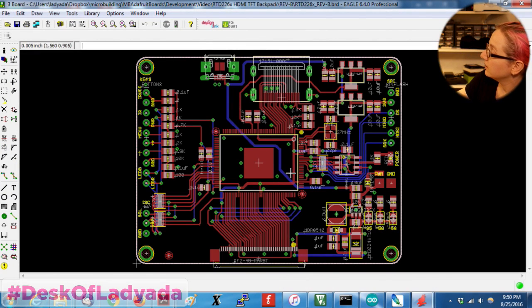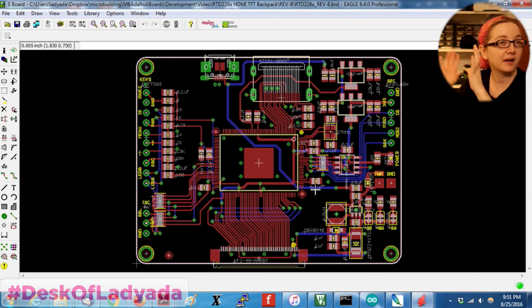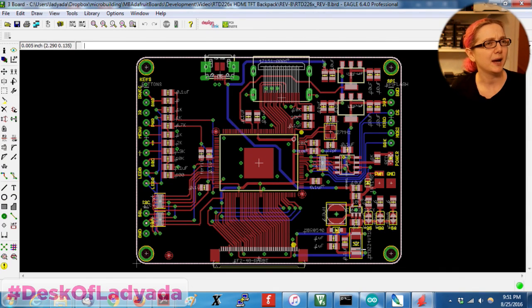we actually had it duplicated. And I tried to actually make it so it's the same size and location, and all the components are named the same, with the same values. I did skip a couple of things. Like, there's a backlight controller for an EL backlight, and I just skipped that part. But otherwise, we just tried to duplicate all of the components as much as possible. And this isn't the final version, but it's just figuring out if this is the correct schematic and layout. And then when we got this, I actually just swapped out this chip, the SOIC.